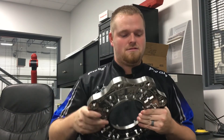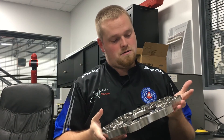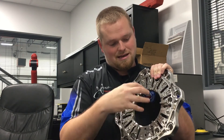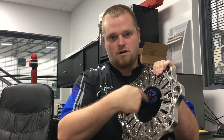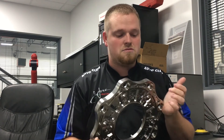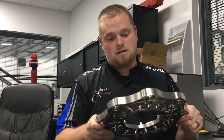When we machine the titanium here, we use a lot of dynamic milling cutting tool paths. There's a lot of material that has to come off the part — we used to cut depth cuts and cut the piece out and there was a chunk in the middle. Now we use dynamic milling, which is faster feed rate, full depth. We use Mastercam for the dynamic milling and it really gets rid of a lot of material in a hurry.